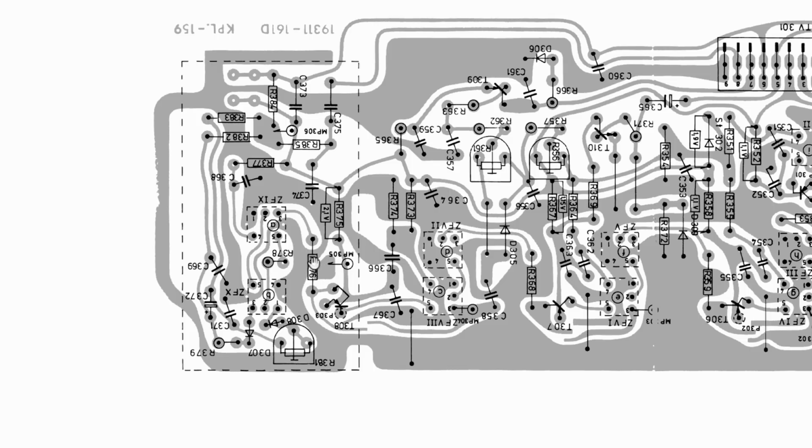From there to wherever it's supposed to be getting the signal, which would be here, this is probably 0.3 picofarads. That's what they talk about on that little circuit for the detector. So that's where I connected to. I actually soldered a little wire in there that sticks up the top, and I'll show you that when we get to it.